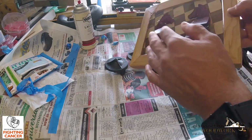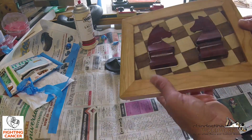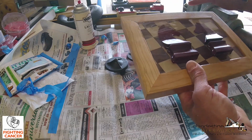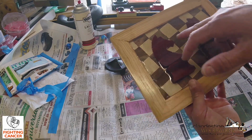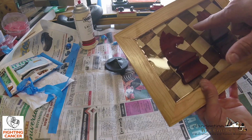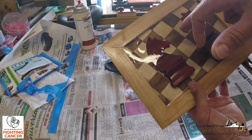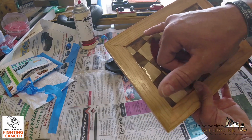In my original idea, this was not sticking up proud as it is. And then, on the fly, when I cut these out, I was like, yeah, that'll work. I don't know how I feel about it. I learned after with the Envirotex, and it says specifically walnut, oak, other open pored woods, that you want to seal it first so that you don't keep dealing with the Envirotex seeping in and air bubbles coming out, which is what I was chasing here for a long time.